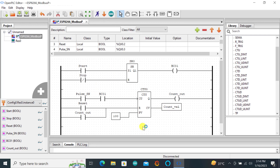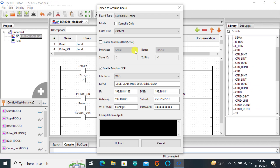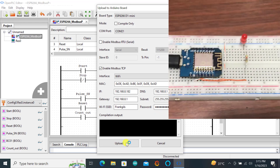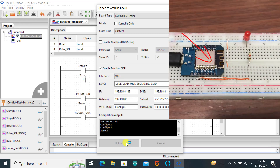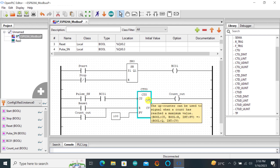With the system working correctly, we can plug in our ESP and click on the Arduino icon to download to the ESP. The board selected is the D1 mini, and the COM port — as explained in the previous tutorial — is set correctly, along with the Wi-Fi setup for the ESP and Modbus TCP configuration. We click Download and the download is completed.